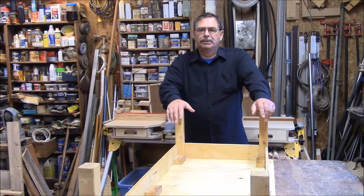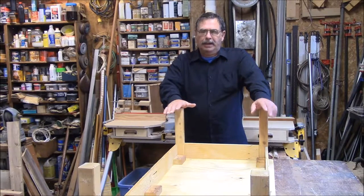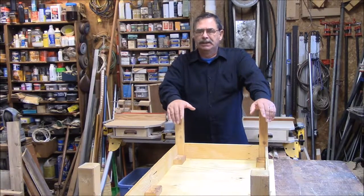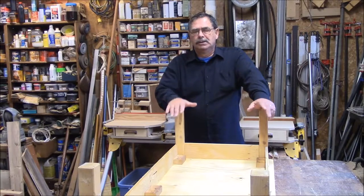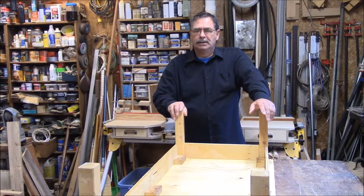So now we're switching over to plastic totes. We got all different sizes. So I measured the biggest one we got, and I'm gonna have to have some clearance of about 16.5 to 17 inches. So I'm gonna go about 18.5 inches to give us a little bit of clearance. So I'll be taking these legs out and replacing them with 22 inch long legs.